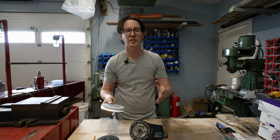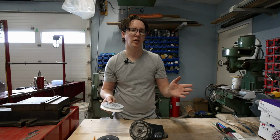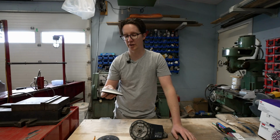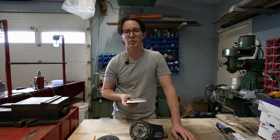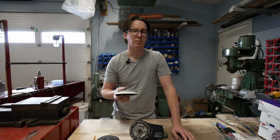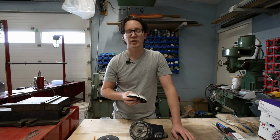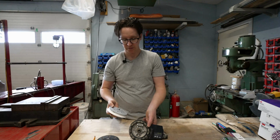If you're doing a lot of flat surfaces and that sort of thing, then probably the hard pad might work well for you. If you are going to more contoured surfaces and that sort of thing, then the soft pad is probably where you want to go. I'm going to be doing some body work on some vehicles, and so I'm going to have some contours around those panels, and so I went for the soft pad.